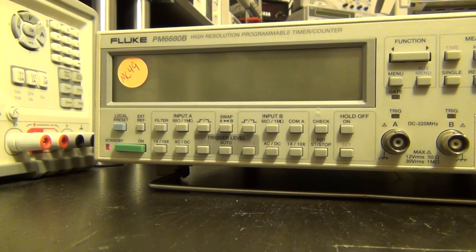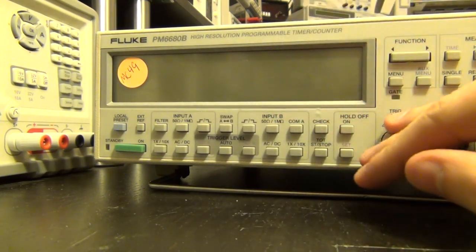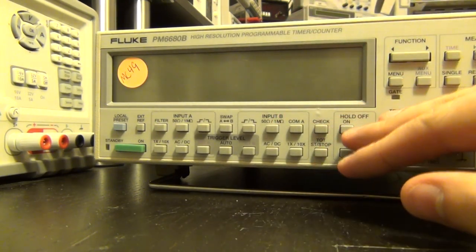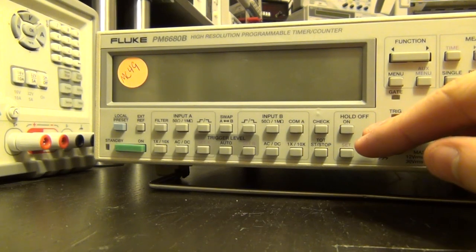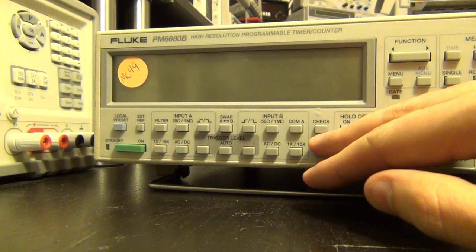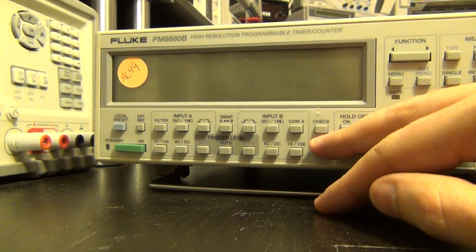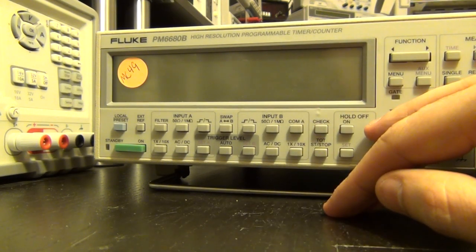So just from the sound itself, and the fact that the sound slowly goes out, it tells me quite a bit of information about the DC-DC supply or the switching power supply that's in there. That can mean that the input is definitely charging up, so likely the rectifier is okay. So that input capacitor is charging up, and then that input capacitor is going to continue to drive the switching portion of the power supply for some time. As it degrades, the charge dissipates away, the sound slowly dies out. So that means something just from the sound itself.